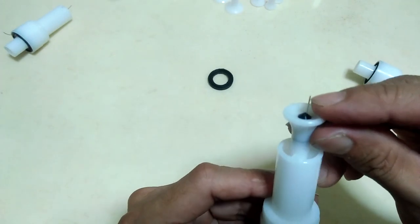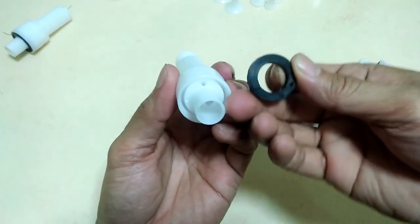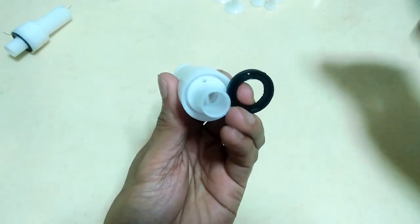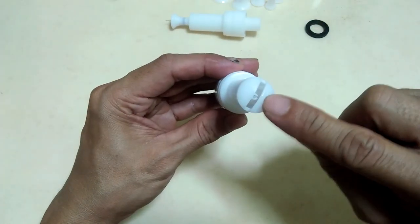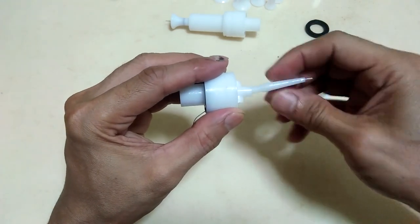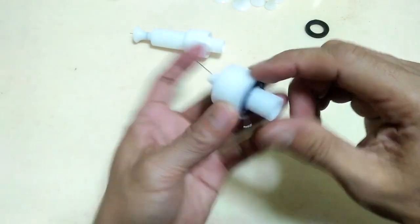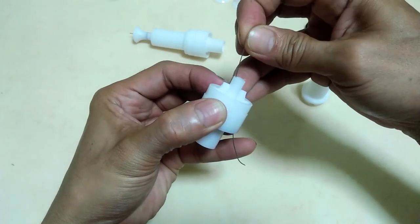You see the thin wire electrode sticking out past the deflector. And here at the base, you see the hole where the connection can be made to the center electrode. The flat spray nozzle is just slightly different. Aside from the end of the collar having the slit, the shaft is just a straight and conical piece. Again, the shaft is threaded so we can remove and swap it easily. And here you can clearly see the other end of the electrode going through the hole at the base of the nozzle.